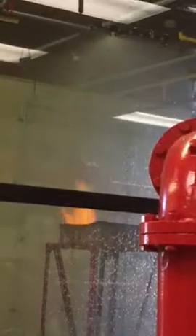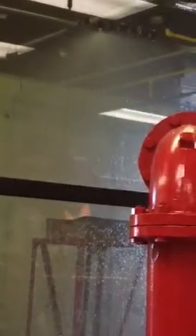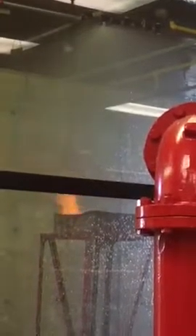Now, I have multiple sprinkler heads in there. Did they all go off? No — just one. Is that one containing the fire? Yeah, keeping it in the pan. Eventually if we let this go long enough, because it's contained, the alcohol will burn off. But you can see it's been running for several seconds. We're at 40 PSI coming out — about 35 gallons per minute being dumped onto the fire right now. And it's just going to continue to burn like that.